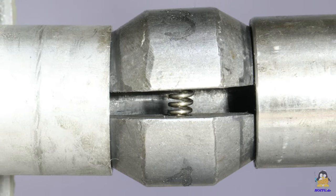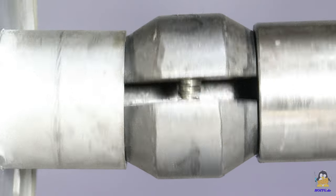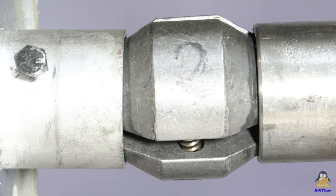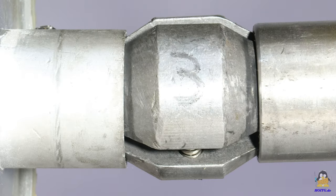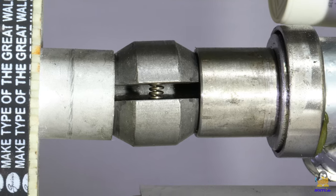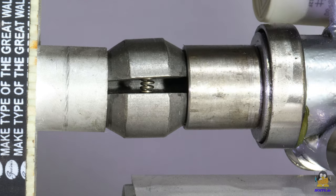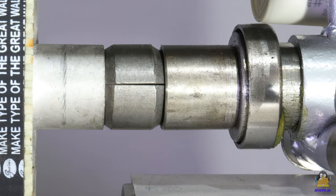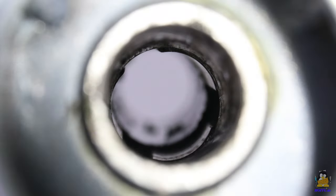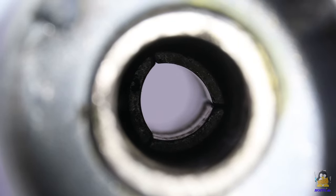The clutch is made entirely of metal. The main element is composed of three parts with conical ends. These components are pushed apart by springs so that the central hole is larger than the diameter of the metal spiral. That unit is placed between two pipes. If the right pipe is moved towards the clutch via the lever, the spring-loaded parts are compressed. The central hole of the clutch becomes narrower and so can grip the metal spiral.